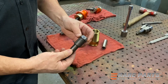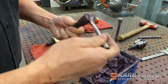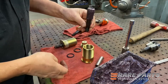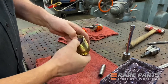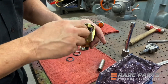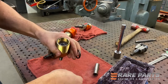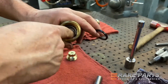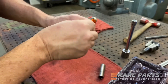Now I'm going to grease up the bearing — just brushing a bit of this onto the stud and packing that bearing as full as we can. Now I'm going to drop the stud and the bearing into the housing and slide it right in. We're going to take the race and drop the race in. Then you'll notice two pieces: the nylon washer and the rubber o-ring. The nylon washer goes on top of the race, and then the rubber o-ring goes on top of the nylon washer.